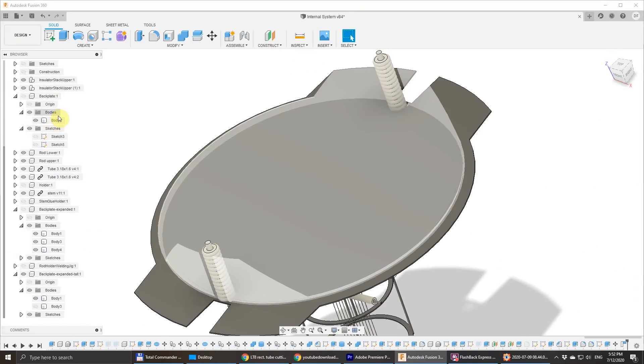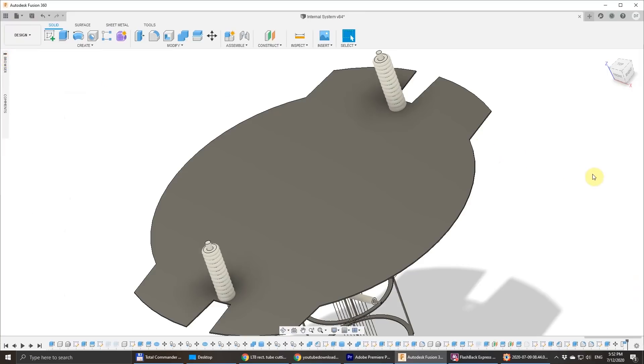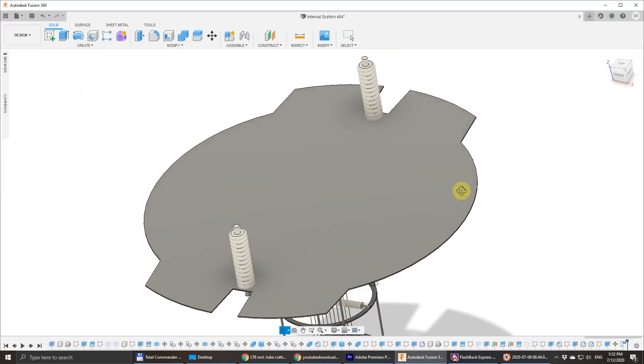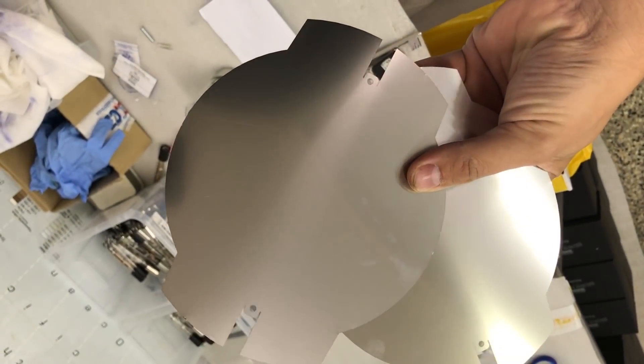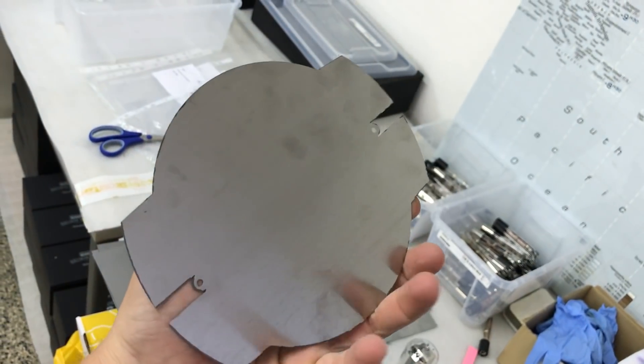I'm taking a different approach. We will take a sheet metal and use a fiber laser to cut a pre-cut shape on the sheet metal. Then we will take these pre-cut parts and use them on a forming die — using a press, we will form the final shape. We will not need to do any final laser cutting on the edges. It will be laser cut from flat metal, which is a standard process, and then formed on a press die.